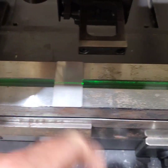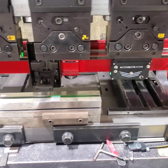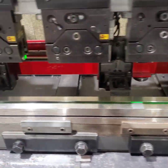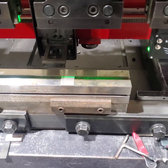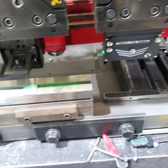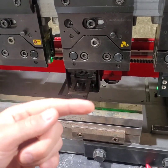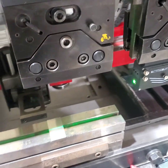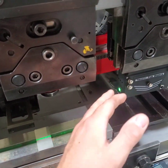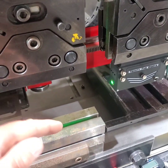If we look here we can see we're centered there and we're centered here - took a minute or so to get it lined up. The good thing is once you pop this out you should be able to throw it back in and have it lined up perfectly in the center of your die every time, no matter what die or tooling you're using. Now you're going to want to run the beam up and down and make sure that line stays consistent and doesn't wander. If it does, it's because your laser is cocked - whether it's cocked in the holder or your tool holder is a little bent.